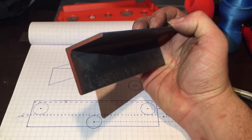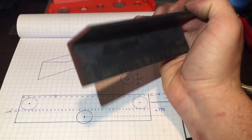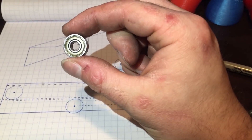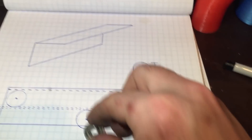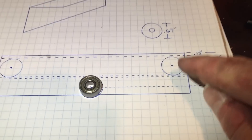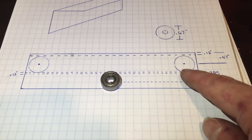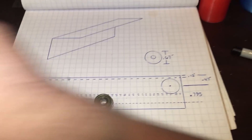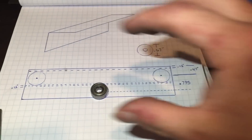There are all kinds of different linear rail setups you can go with. This particular setup is so inexpensive because it's all based off of this angle profile — the same material used for both the carriage and the rail itself. It's all based off of these hobby bearings, which are about 50 cents each on eBay. These are 6 millimeter inside diameter. If you space them appropriately — two on top, one on the bottom — the carriage is going to slide really smoothly across that rail.